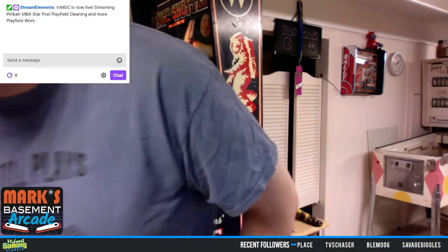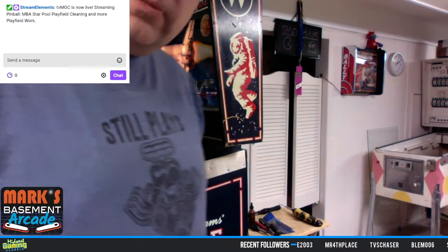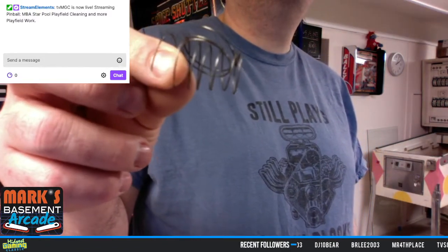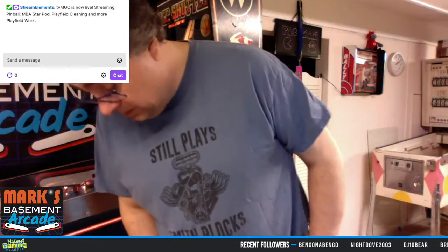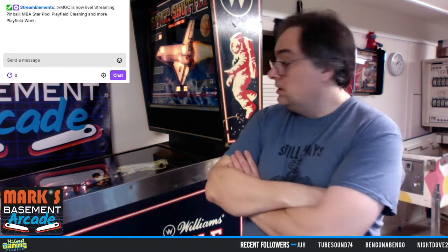Right flipper, the spring. I don't know if I still got it over here or not. Oh, here it is. That's the flipper spring. That's exactly how I pulled it out of the machine. So the flipper wasn't doing its flip. I put a used one in there, so now that flipper works perfectly.